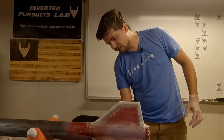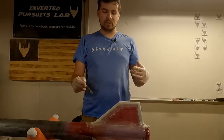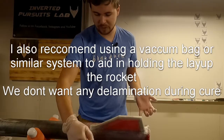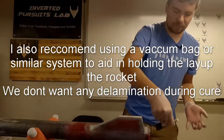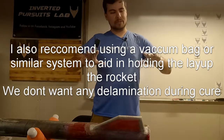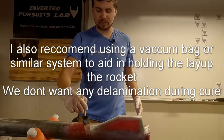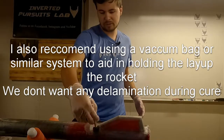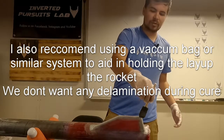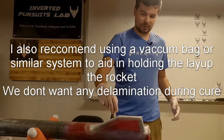That's the basics of the layup process. It's not very hard — you just lay everything on there and wet it. The hardest part about doing these is that you have to stretch it. As you can see here, I flared the fiberglass on the front and the back. It's actually rotated because fiberglass will actually stretch since it's a fiber — you can actually shape it to odd curves and interesting angles. You'll notice it has curves throughout it, which is no big deal. I'm going to be going back at this with some sandpaper once it's all dry to clean up any rough spots.